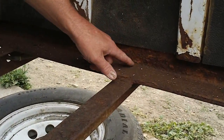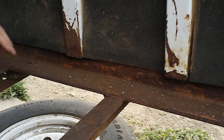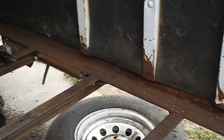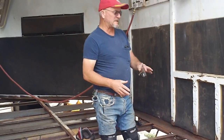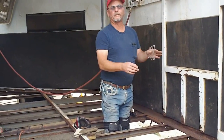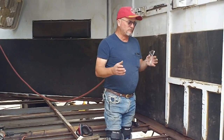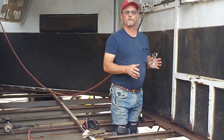You can see these pieces, but they're not flaked — they look like they'll come right off, but they will not. This is the deterioration of the metal surface — big chunks. Now, if it's bad enough, you're going to have to put a new piece. After you've cleaned this, you weld a new piece that's identical or just slightly smaller over the top of that, and you over-sheet it, which will allow you to continue to use it relatively safely, unless it's deteriorated to the point where it's extremely bad and has lost all its structural strength.